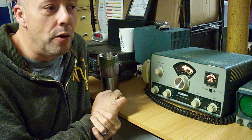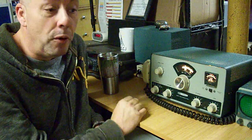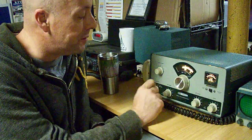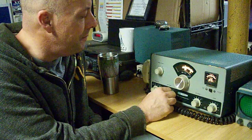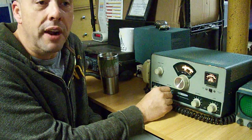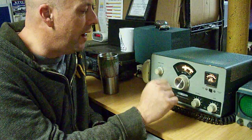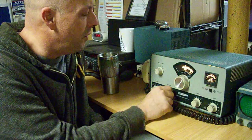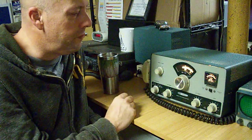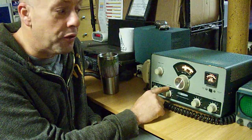One drawback of these rigs is they were invented long before DSP. But a lot of hams forget what the RF gain control does. If you have a weak station, the best way to pull them in isn't with the volume and trying to listen harder — it's with the RF gain. You keep the audio set at a comfortable level and walk the RF gain to bring in the station. It comes in a lot clearer. When you max the RF gain and turn the volume down, the signal doesn't come through as well. You get better audio when you leave the AF gain set and walk the RF gain control. That's a little tip.